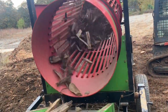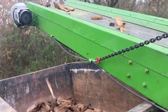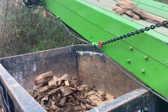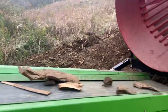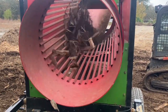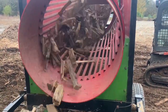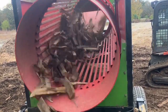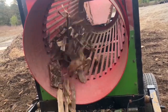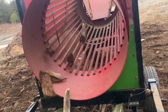The great thing we like about this screen is you could set it up for a traditional operation where it's just doing wood as it's being split. But this is a high-volume trommel that can be fed with a skid steer, and it's able to extract even stuff like this where there's more dirt than firewood coming out — heavy with a lot of trash in there. But it's a 10-foot long drum, 43 inches in diameter, and it's really able to process it quickly.